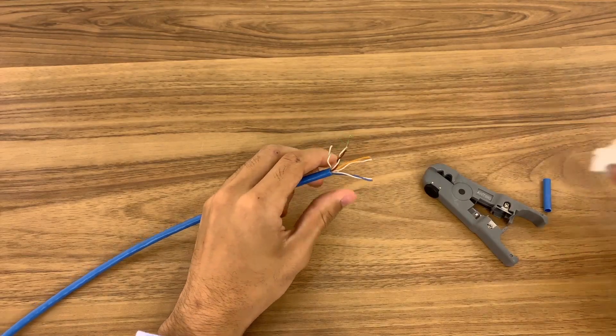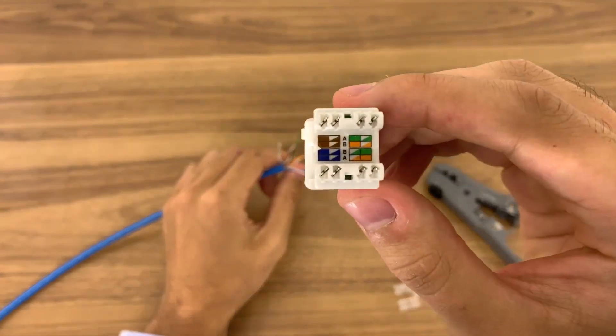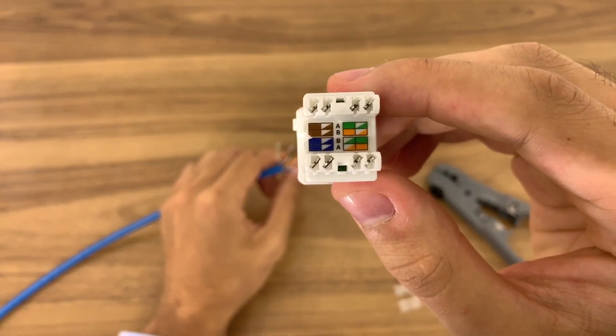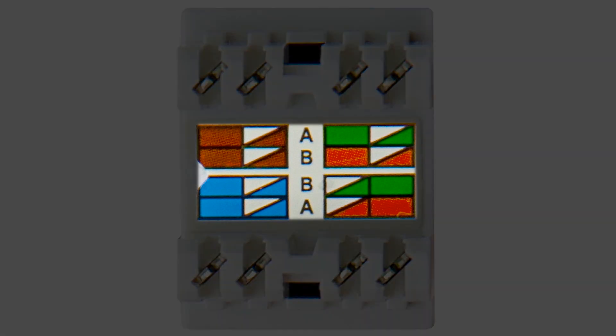Here is the back view of a typical CAT6 RJ45 jack. As you can see, it is colour coded to match the wire colours. This particular arrangement may vary for other manufacturers but they follow the same colour scheme. There are two types of wiring standards labelled A and B as shown. A and B offer the same electrical properties and either standard can be used. For a straight through Ethernet connection, the RJ45 jacks must be terminated with the same standard.